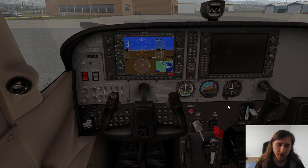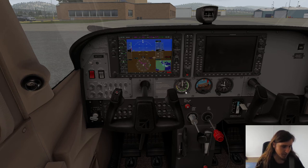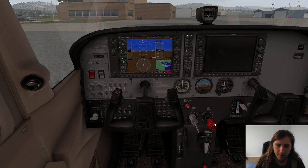Now we are ready to start cranking the engine. We pull the mixture all the way out again because too much fuel could be a problem — we want just enough fuel. We start with the primed fuel system but the mixture will actually be in the cutoff position. To start the engine, we turn the magnetos — click, click, click — into the both position, and when we turn it to the start position the engine will begin spinning. It's spring-loaded, so if you let go it clicks back to both. Once the engine does start and catches, we'll hear it because it makes a lot of noise and starts spinning fast. We need to act fast and push the mixture all the way in, otherwise the engine will be starved of fuel and will shut down again.